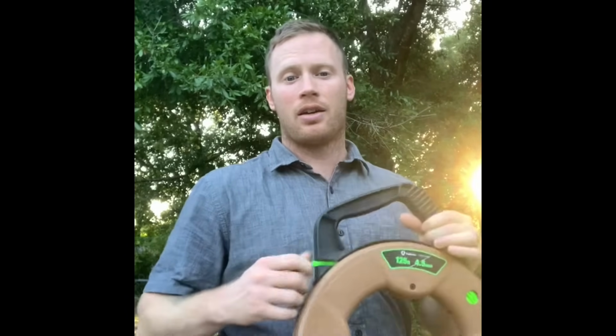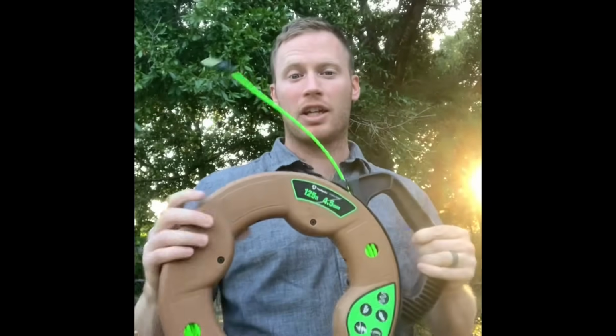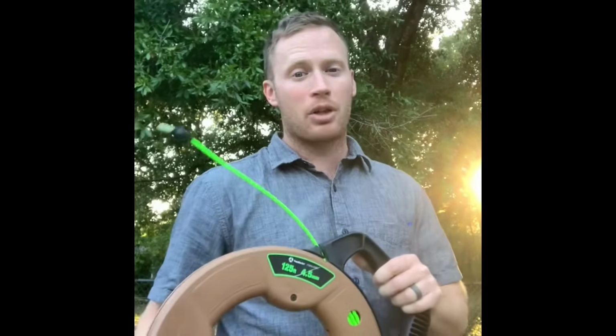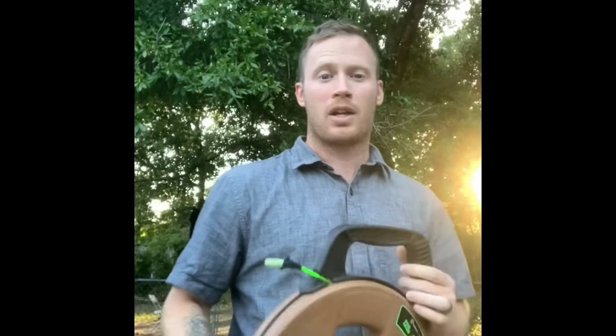The other tool that I'm going to be using today is this fiberglass fish tape, 125 foot you can get. This is Southwire. You can get it from Lowe's. It's non-conductive, and I'm going to use this to push through my conduit and pull my wire through my conduit from my panel to my new box. This just happens to be the one I have today, but it's an awesome tool. It's fiberglass, it's non-conductive. I have a steel fish tape as well. Don't work on anything hot.